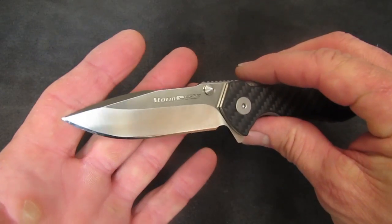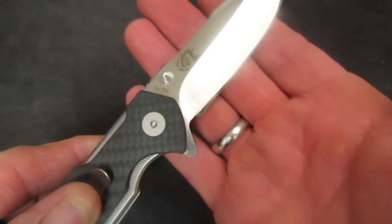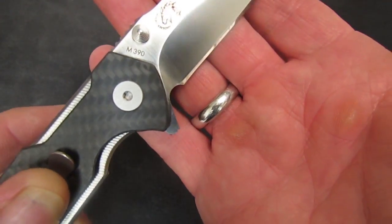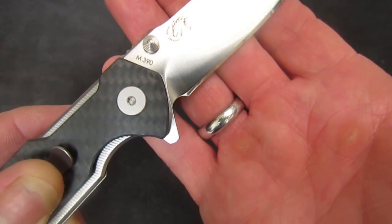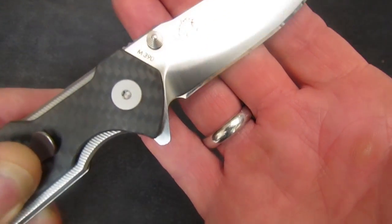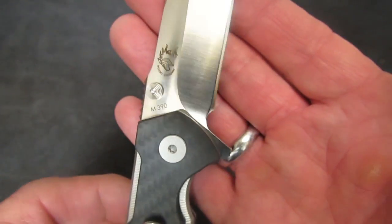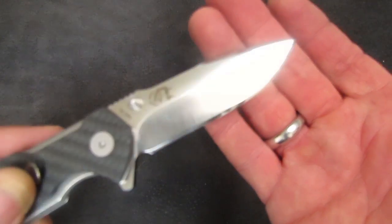For a 3-1/8 inch EDC blade, it's just too fat. As usual with about 85% of manufacturers, they didn't quite finish the plunge grind before the choil ended — I did not enhance this one at all. We got a little bit of flaring and a little recurve caused by that. Nice set and finish otherwise.